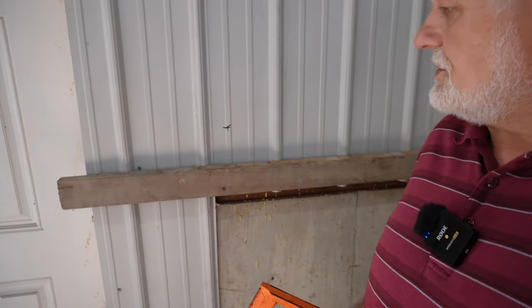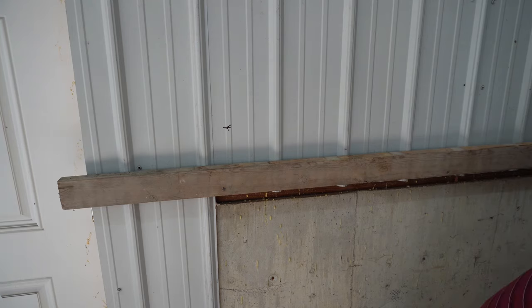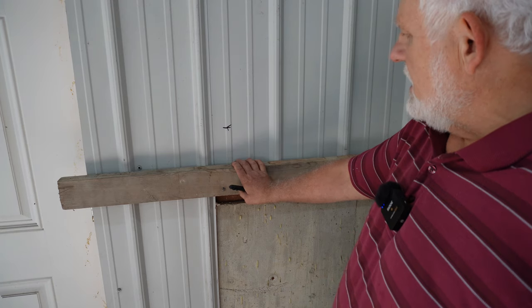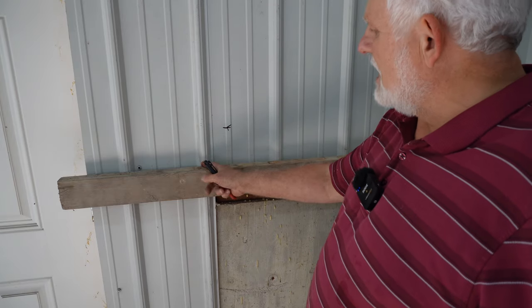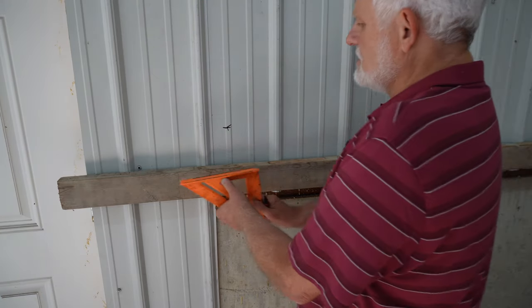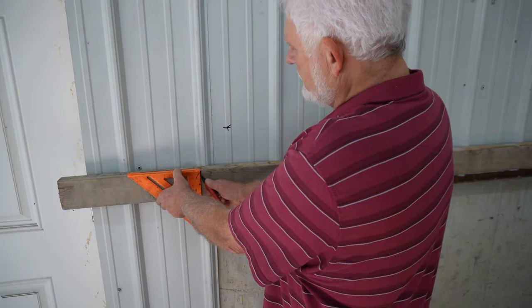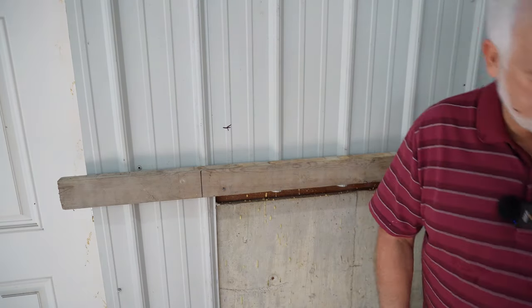Those are the basic tools. Now to cut this, all I'm going to do is figure out where I want to end my shelf. I know that this 2x4 is 16 feet, so somewhere in here, just so that it ends up on this rib since it's higher. I'm going to cut it right in there somewhere — I'll take my square, place it right there, make a line, then get my saw set up and cut that.